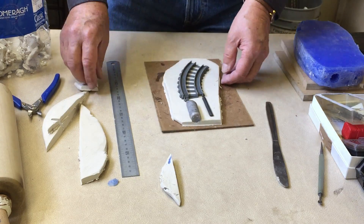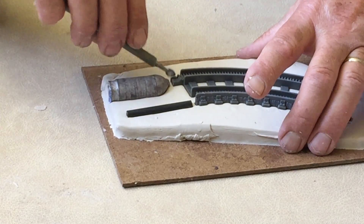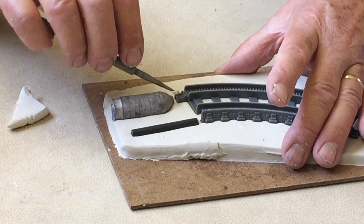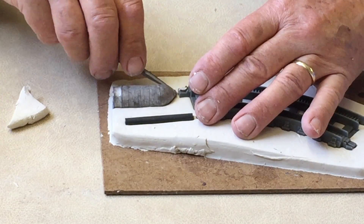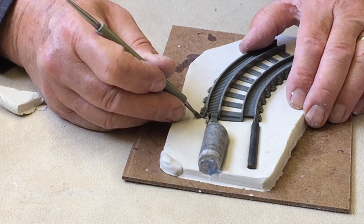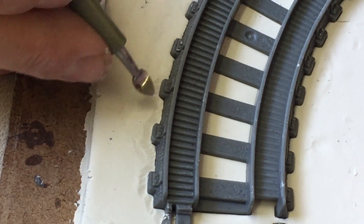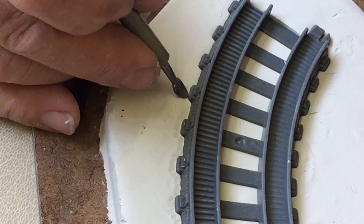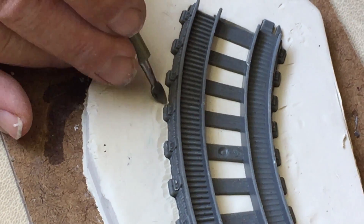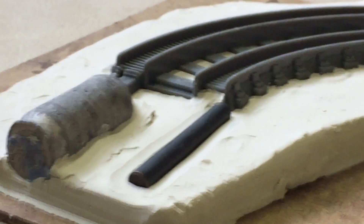The smaller the mould the more economical it is. Then you need to begin to flatten the corners. There are small spaces that need to be filled — you can use a little bit of the clay to shove it into those corners and gaps. The clay is very malleable and economical so you can always remove or add as much as you need. Once completed, begin to push the clay against the master so that there are zero gaps, because gaps will distort the eventual casting. So carefully pad it all the way around on all sides so that it's flush with the clay.